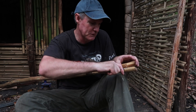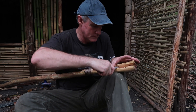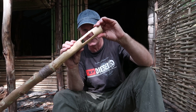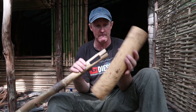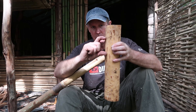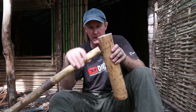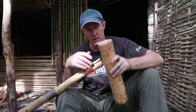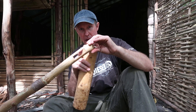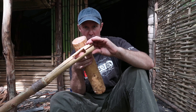Being careful not to completely tear the end of the wood out. Now I've got that hogged out — you can see if I close it up, I've got a nice little slot there. Now the fun part: I've got to take the head piece and make it fit inside that slot, so I've got to thin it down, but only a section in the middle, leaving the rest thick. When I slide that in and lock it up, it can't pull through either way. I want it slightly larger than the slot so I can't completely close up the split once it's in there — that'll hold it all in nice and tight with no wobbling.